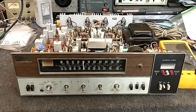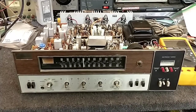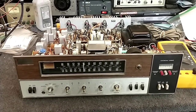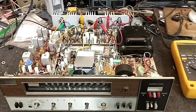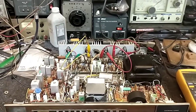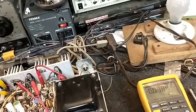Let me get some test leads and jumper across the blown pico fuses and power it up, because this is a full DC complementary amplifier with no protection at the speakers. The only protection would be those fuses opening to stop current through the output transistors — unless there's a collector-emitter short, which there isn't. All fuses are bypassed, we're on a 100-watt dim bulb tester. Let's fire it up — the light is on but there's almost no current draw, which is kind of weird.